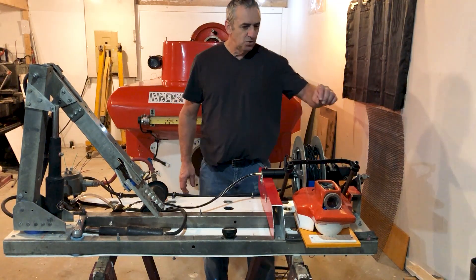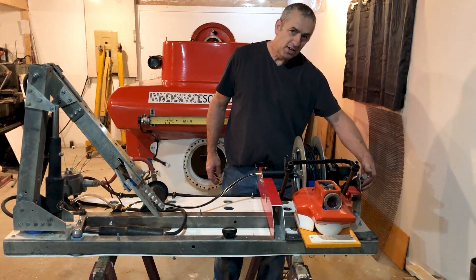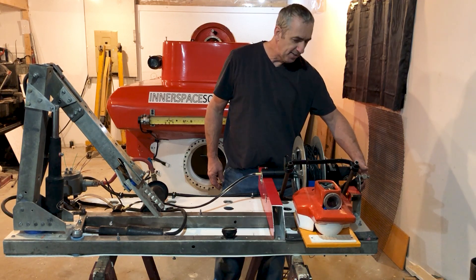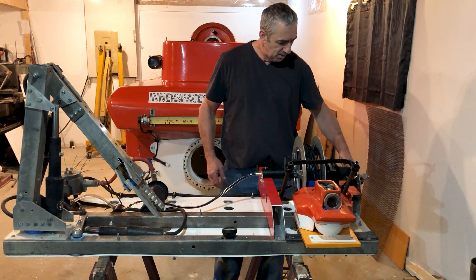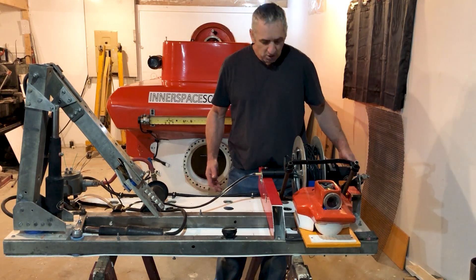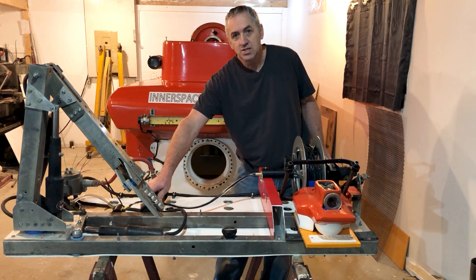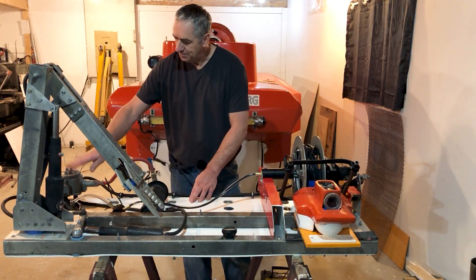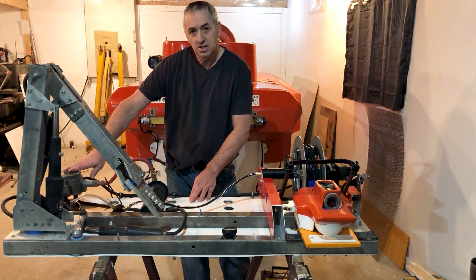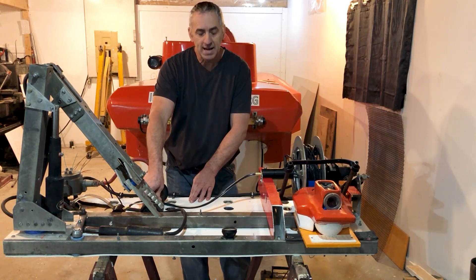The part that drives the clamp here is another Lenco actuator that I've modified for deep use — also oil filled and pressure compensated. What I did is I tied into the compensation system that's existing for the arm, so I simply ran a hose over. The wiring goes into the same junction box that the arm goes into, and then I tie it into the existing bladder.